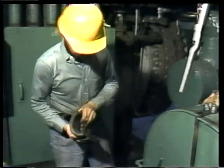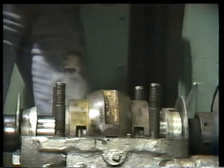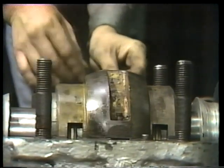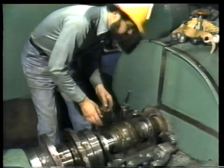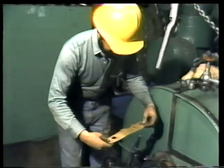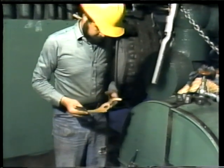The next part to go on is the upper bearing shell. Before installing it, make sure it's clean, and check the markings so the inboard end points toward the pump and the outboard end points away. When lowering the shell into place, line up the grooves in the shell with the ridges on the bearing inserts. Next come the pins that lock the two shell halves together — since this bearing has tapered pins, they snug themselves down without hammering. When both are in, make sure the shell halves fit together tightly and spin the oil rings one more time to make sure they're still free to move. Before the housing goes on, install a new gasket. In this case, a fiber gasket is recommended, going on in two parts to leave a space for the pump shaft.